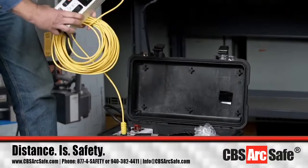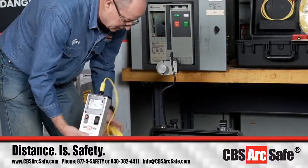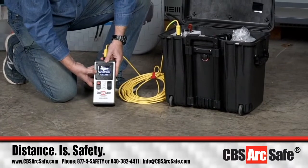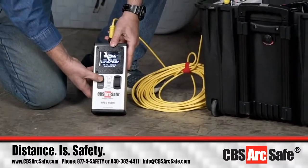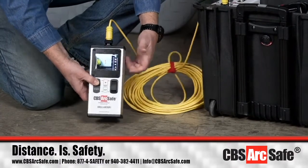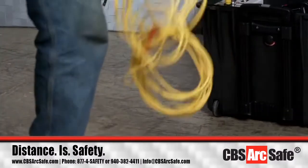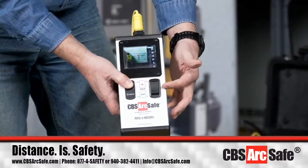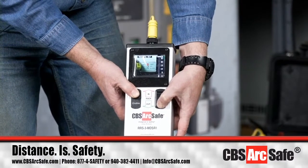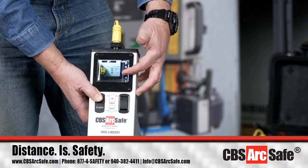You'll notice that you've got on here the Enable and the In and Out buttons. You have to hold down the Enable the entire time. We're going to turn our power on, hold down the Enable when it finishes booting up. Since the breaker's racked in, we're going to hold it down to go out. It's generating about three or four foot-pounds right now. You can see the green now all the way down at the bottom for the breaker being fully racked out.